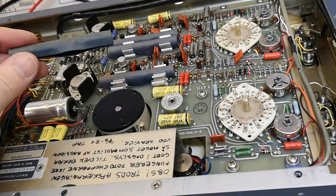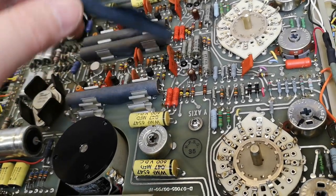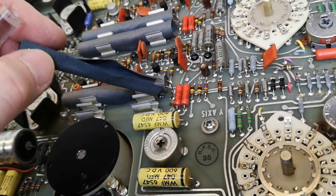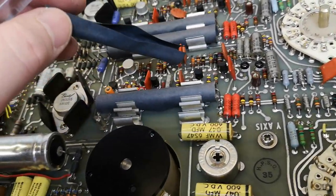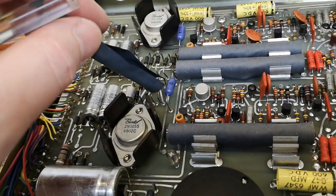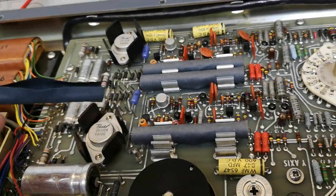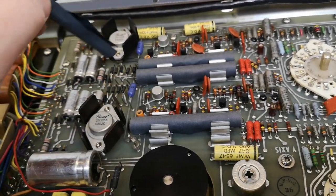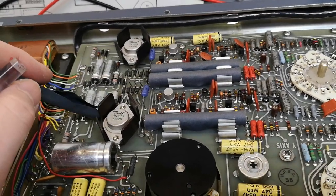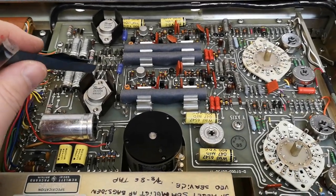But it's really, really interesting to see how this was built, how all the different circuits they are invented, how this LDR and this chopper stuff is working with the input circuits and the amplification, and then the pre-driving, and then the output driver, rectifier diodes to drive the motor, the two motors here and all that. It's really, really a smart way to PWM using mains frequency to the motors. So I really like the idea and all the design stuff in this one. Super good.